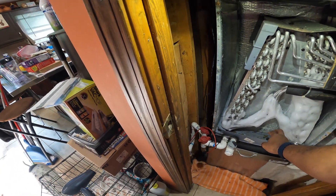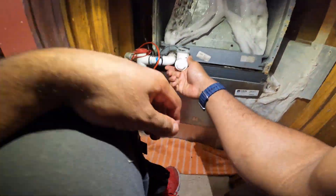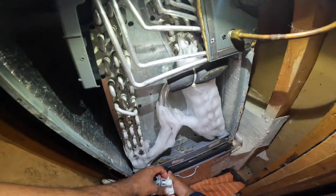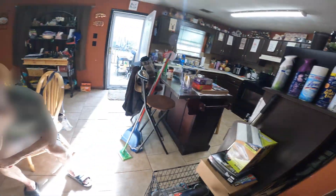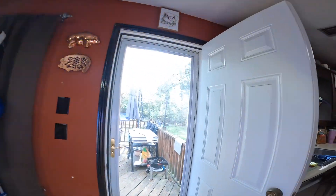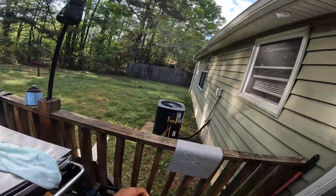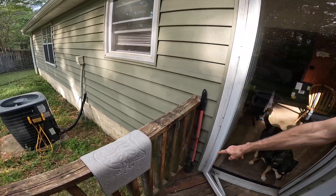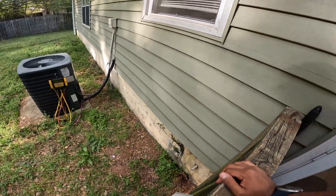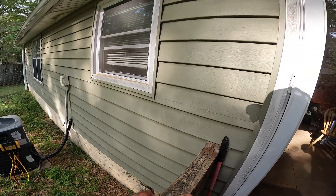Actually, that's what's going on right now. You can see it building up in the drain pan — it's not even going out. Your overflow switch is flooded. That's not good. Where does it drain out? Drains out here. So it's draining just a little bit. Let me go ahead and unclog that.